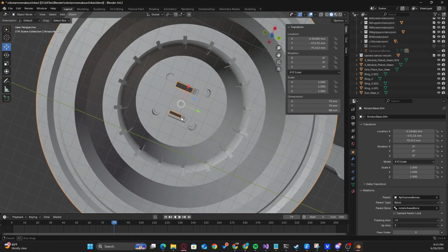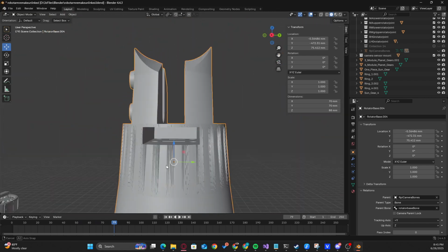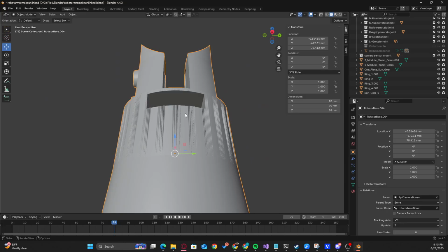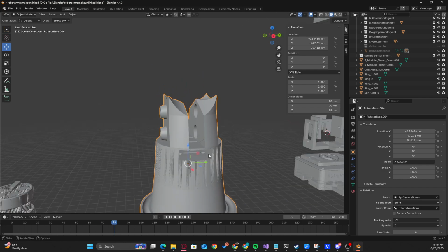These slots are there because you're gonna have to put the pins on the encoder. I think you could easily do it the other way too, where you slide the wires through from the top, but they have to be in here. So you slide the wires through, because this is where the wires come out from, and then you solder directly onto the board. Like I said, after I show how to build this, I'm gonna show the wiring. But what I did is that I put the pins on them, and that's why I created those holes. So that's the main part where the wires come out through this side.